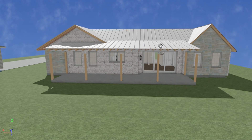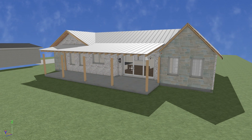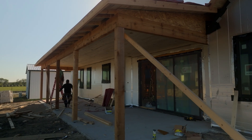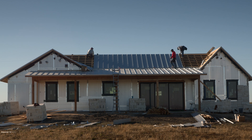The other thing we did from a design standpoint is we pulled out these porches on the front and back — the original roof didn't come out over these porches. That allows us to see the sunrise through these big sliding glass doors. That's a big 12-foot door that opens up, and you can see through it from the inside. In the summertime, you can open it up and have indoor-outdoor space. But after about 10 o'clock or so, depending on the time of year, the sun goes over that porch, and now you're in shade — so you're not taxing your house with sun coming right through the windows.